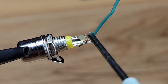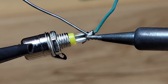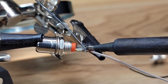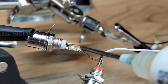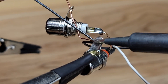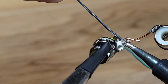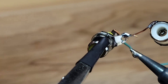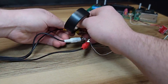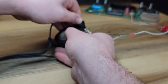Now it's time to attach the video and audio wires to the female connectors. The yellow video connector will receive our video-out wire as well as a ground. The audio-out wire will connect to both the red and white female connectors. Lastly, I'm connecting the black ground wire to all three of the connector ears. Because I've chosen not to drill holes in the case and mount each connector externally, I'll go ahead and use electrical tape to insulate each of them.